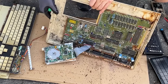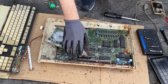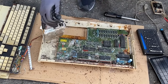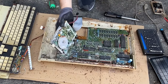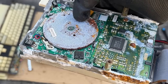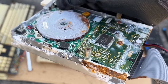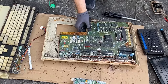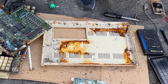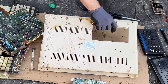Let's get this floppy drive out of the machine — it just sort of fell out. I don't really think there's ever a chance this drive is going to work again. Mechanical things with moving parts really don't like moisture, and just looking at this drive, you can tell it's been exposed to a lot of moisture. Take a listen to the spindle when I try to turn it — it's crunchy, which it shouldn't be. The motherboard comes out with the attached RF shield, and you can see the rust residue left behind from the rusting RF shield on the bottom.